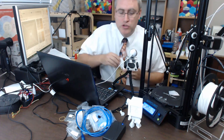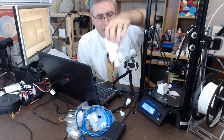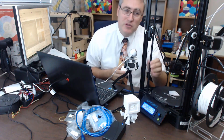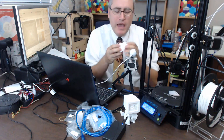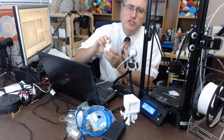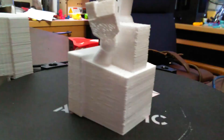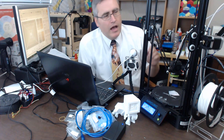So I turned up the retraction, turned up the extrusion multiplier just a little bit, and found that one of the screws was super loose — that's probably what caused the vertical walls to look like garbage. I tightened the screws, tightened the belts a little bit, and printed another one. It looked a little bit better, but the back corners still looked terrible, and there's a part where it gets so thin you can see through it — the extruder just wasn't moving plastic properly.